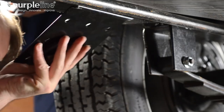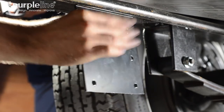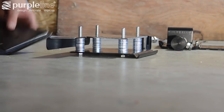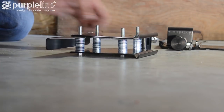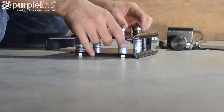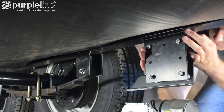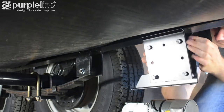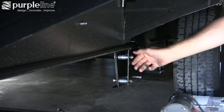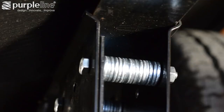For your I-beam trailer, it's a bit more of a process. Ensure that the chassis hanging brackets fit the frame of the trailer as well as clear all other trailer components. Once you determine the spacing between the clamping plates, you can stack the correct combinations of spacers, bolts, nuts, and washers, as well as the L-shaped bracket. You can hang the entire assembly from the chassis and slide it into place.